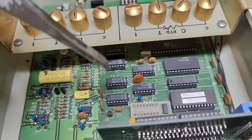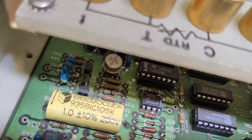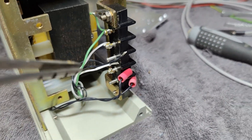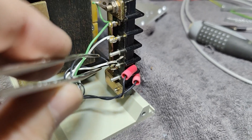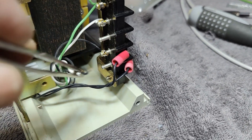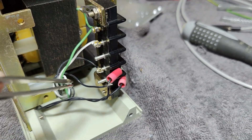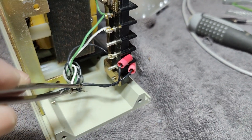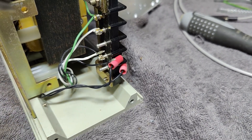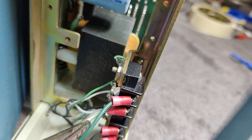Normally all the date codes are more or less plus-minus a few years. Here is some... LT1001. So that will be the four wires for the mains entry. We had two black wires there and two white wires going there. So I just cut a random white and a random black one. And now there is no connection between these two when I take my ohmmeter.